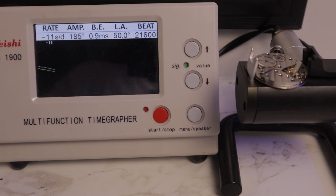If the two dots didn't line up exactly, adjust the lift angle so the amplitude reads either a little more or a little less than 180 degrees, depending on how the dots lined up. If the dot swung just beyond the reference dot, adjust the lift angle until the amplitude is slightly more than 180 degrees. Simply record the lift angle you've determined, fully wind the watch, and you will have an accurate amplitude reading on your time grapher.